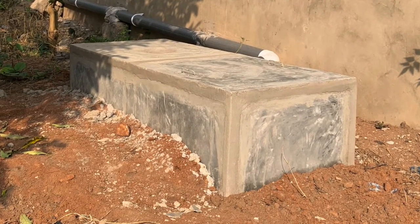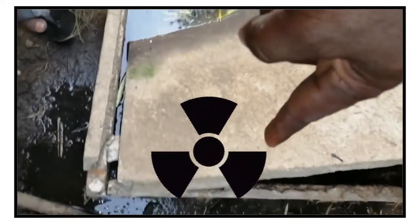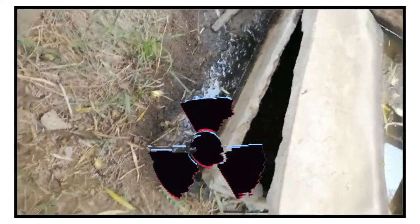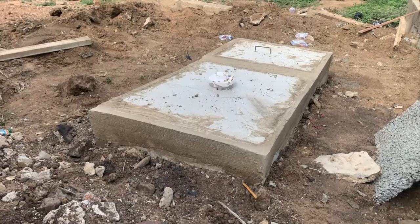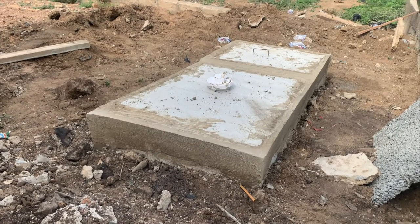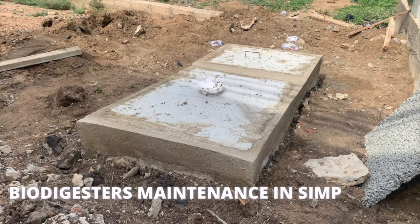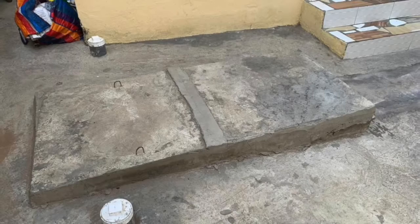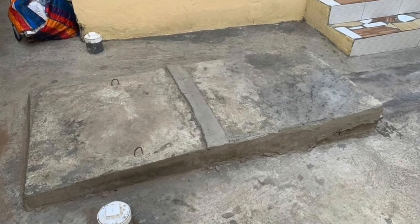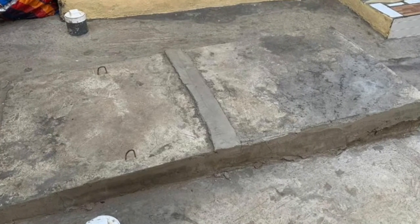You can actually see that it's like there's a leak here, that there was no impact in here. How do we do maintenance? When you call us, there's a problem with your biodigester — either the top slab has broken and water has seeped into the digester, or it's not working well, or you can smell something, or you can see something outside the digester tank — and you give the installer a call.